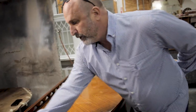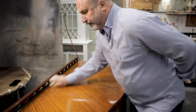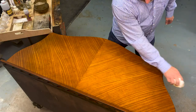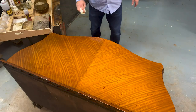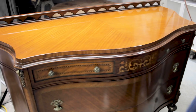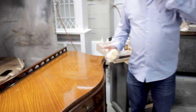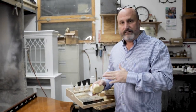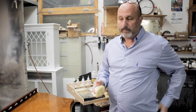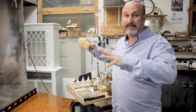It's dry now — I can continually build this up as long as I want, and I don't really need to use sandpaper or steel wool; it's only when I run into a problem. That would be my finished coat on here. It's a little too shiny, so I would let this dry — clients let it dry three days in the house. We'll let it dry in the shop for a few days. I'd probably give this a light steel wool and then a coat of paste wax, which is another product my brother custom makes and formulates, and that gives it a little more of a supple satin semi-gloss luster rather than this high-gloss luster.